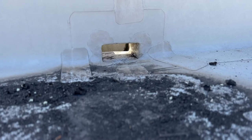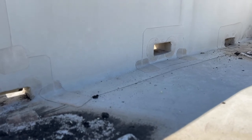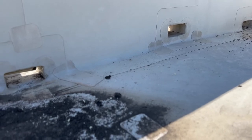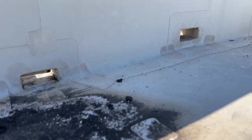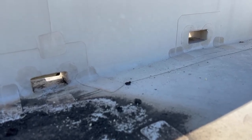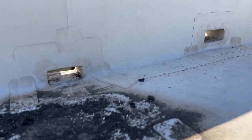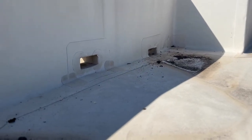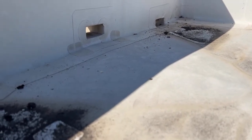The area just in front of the scupper is a little bit higher than the rest of the roof. Over here we have an overflow drain — think of it like the drain in your bathroom or kitchen sink. If there was a torrential downpour on this roof, it makes it so that the building wouldn't flood, or at least minimizes flooding. Those drains typically don't run into a gutter system, although they can. You'll typically see a scupper and an overflow drain side by side on a lot of roof systems. On this one, there's even another scupper right next to this one with a center cricket that runs perpendicular to that overflow drain.